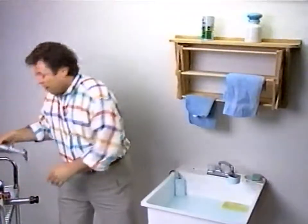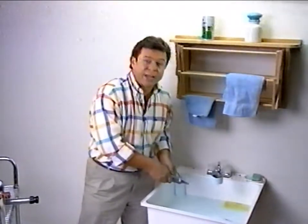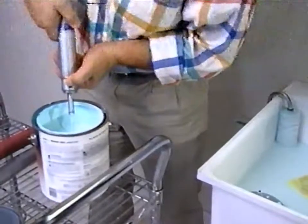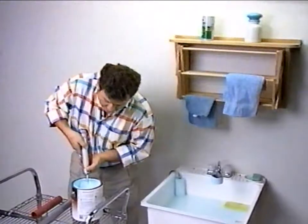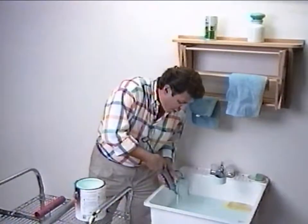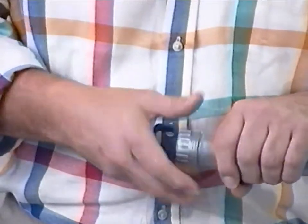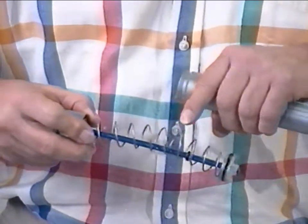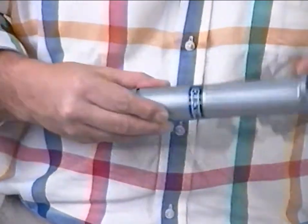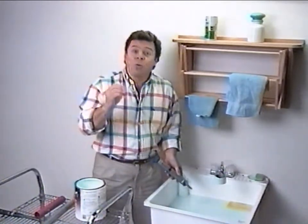To clean the Quick Painter, run the paint pad under water and clean it off — it's made of neoprene so you don't have to worry about it soaking. For the paint left inside, press the trigger to expel it. Then stick the Quick Painter in the water, pull back on the handle to load it with water, give it a few shakes, and the dirty water comes out. Do that two or three times and the system is totally clean. To finish cleaning the inside, unscrew the back handle, put Vaseline on the O-rings, and push it back inside while pressing the trigger. Screw it together and you're done. You don't waste paint, you don't waste time, and you don't waste money with the Home Right painting system.